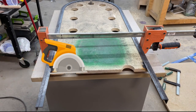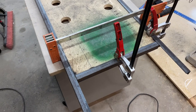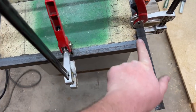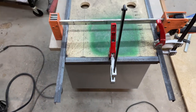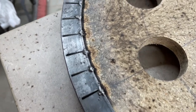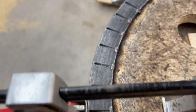I ended up cutting this jig a little shorter to accommodate a little cross brace. Cutting the jig shorter allows me to put that brace right on the edge, making sure it's nice and square with the rest of the frame, and then you just weld it in place. Once I had that bottom cross brace welded into place, I went around the arch and tack welded all those little kerfs so the metal frame will now hold its shape.